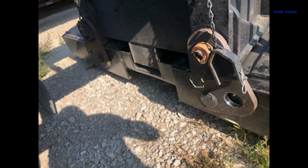And if you notice here in this last photo, you can see a little bit of gap between the hitch and the bed of the trailer there. Well, quite a bit of gap actually. That makes the hitch tilt back, essentially what it does, and it gives you a gap there, and that drops the ride height of the trailer. Now, some of you might be saying, oh, that's dangerous. But this trailer manufacturer actually does make these three-hole plates that I just built. That does allow the hitch to run at a different angle like that and drop the load down. So it is a factory-approved method of dropping your ride height.